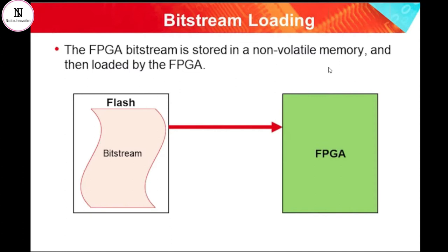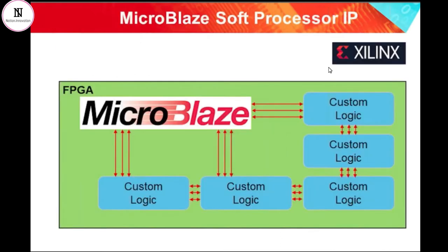One example of this that you may have seen is to use a ready-built IP core such as the MicroBlaze 32-bit processor that is provided by Xilinx, who incidentally are the sponsors of our webinar today. The result of integrating a processor core as a soft implementation inside the FPGA is that it becomes tightly integrated with the rest of the logic in the FPGA, simply because it is sitting right next to that custom logic inside the device.